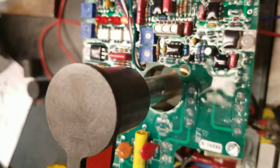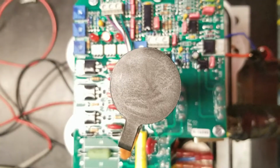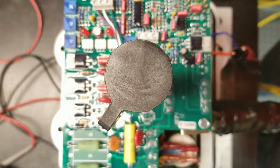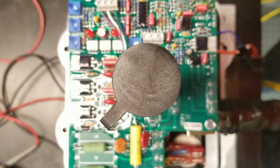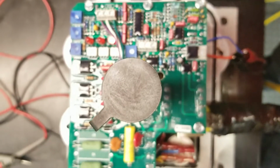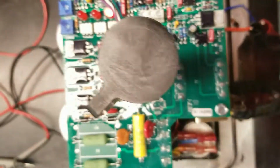So we're in the open position, or full counterclockwise, at 20 milliamps. We want to give it 12 milliamps now. This actuator should rotate around until it gets to about 50% position, and it's going to stop. So here we are, we're at 50%. The motor stopped, and we're tracking good with our position.